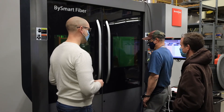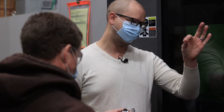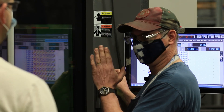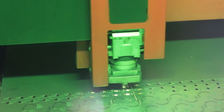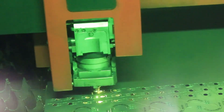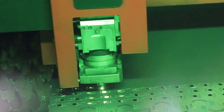Ray knows his stuff. I'm glad the dimensions worked out — I tried to do a lot of measurements and test them, but I didn't know if the width of the laser was going to cause trouble. No, I can actually control that — like the holes, if they were a little small or a little big, I can go in there and change the offset. When I program on the computer, that's one of the things you do: you tell it which side of the line you want to cut on. The beam is about seven thousandths of an inch wide, so it takes that into consideration. As far as repeatability, we could cut something within a couple of thousandths of an inch over and over again.